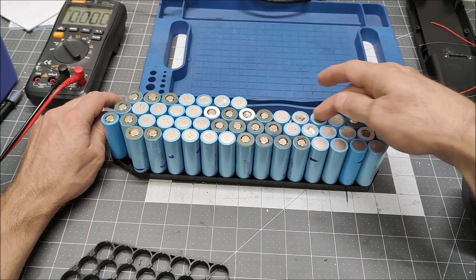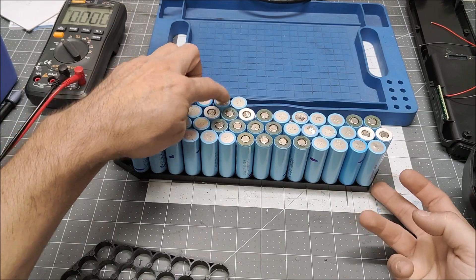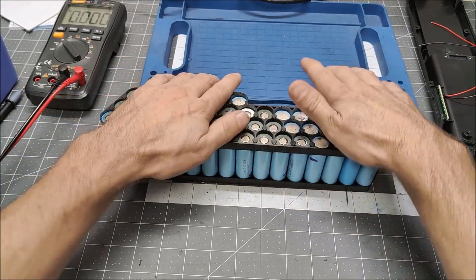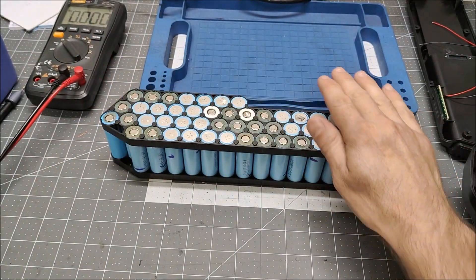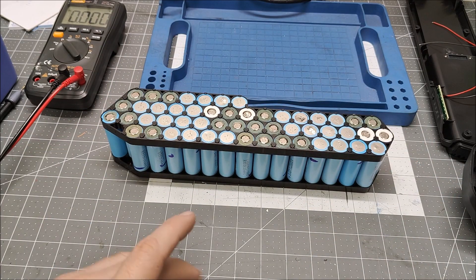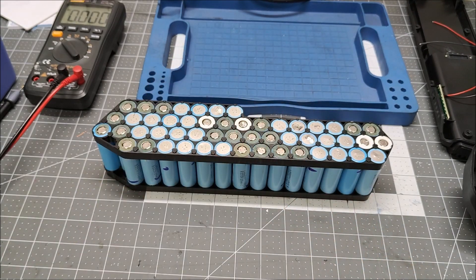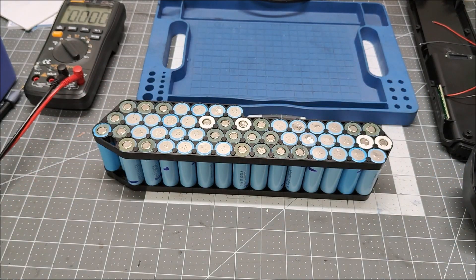The battery runs in a serpentine pattern — this will be the main negative on one side and the main positive on the other. I'm reasonably happy with the design. There are only one or two groups where I'll need to zig-zag the nickel, but for the most part I'll be using long strips of nickel to connect the cells, which gives simpler, cleaner, and stronger joints without double nickel. I'll stop this video here, and in part two we'll begin spot welding, attach the BMS, and test the battery. This has all the signs of being a good battery since we're starting with healthy cells.